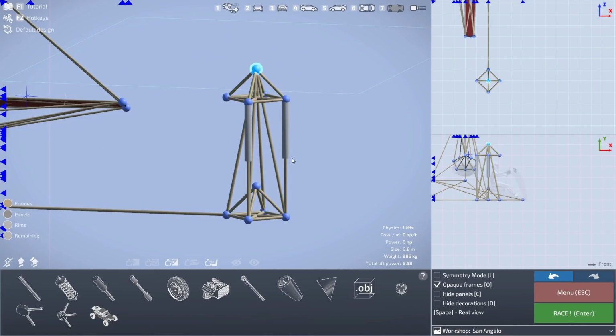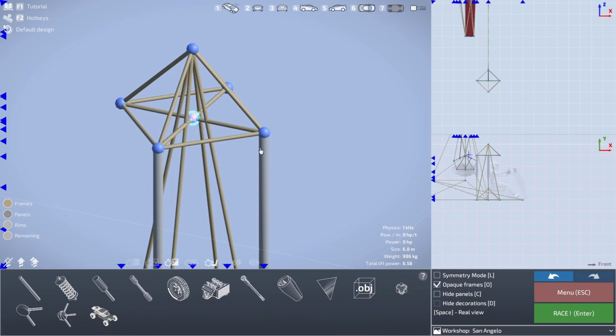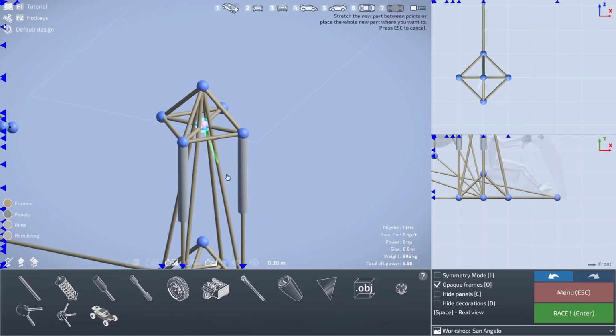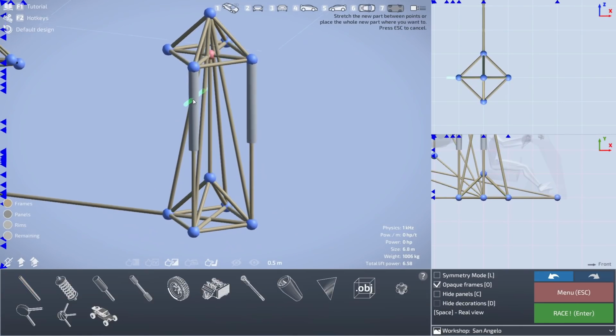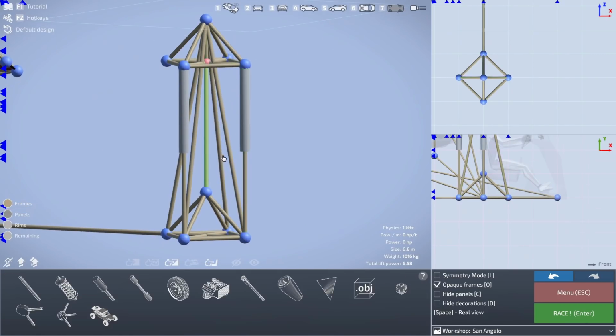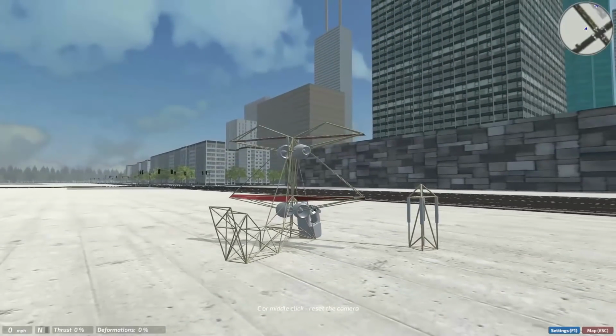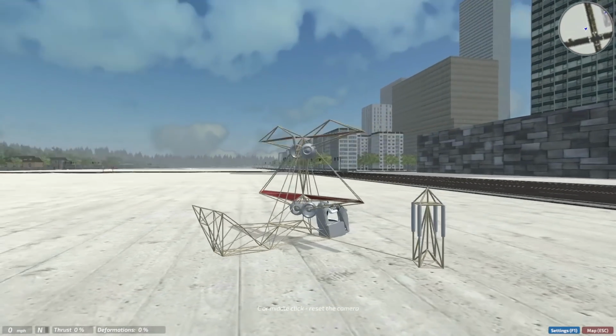One of them was using midpoints like this, and then connecting everything together. And I added actually back in the other 2 rods, but just told them to do the opposite of whatever the opposing rod was doing. So if one rod was expanding, the one on the opposite side is contracting, and what this would do is just allow the whole thing to be a lot more stable.